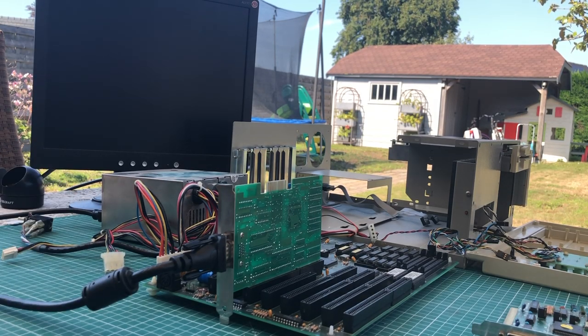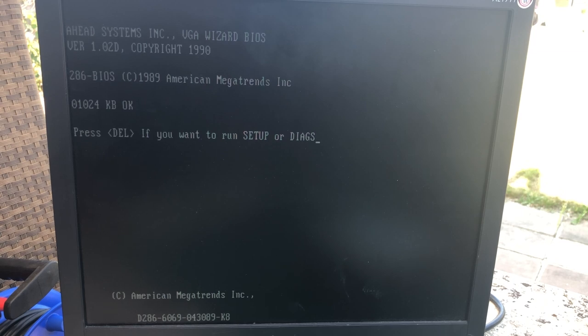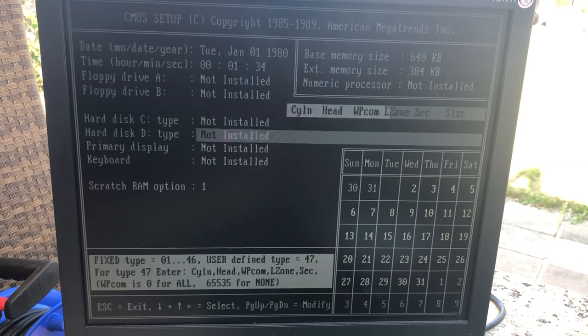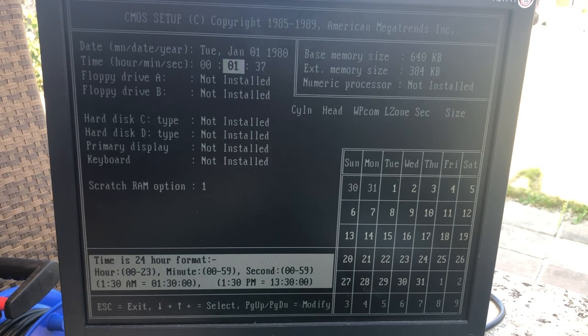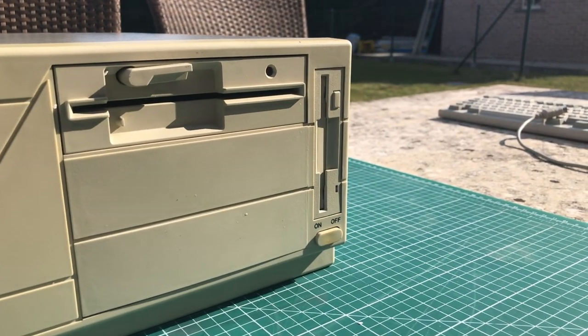Final test of the day: I've got the VGA card hooked up to the mainboard and the power supply connected. Starting it up — and holy moly, we get to see the 286 booting with a one-megabyte RAM count! There are going to be some setup issues since the battery has gone dead, but after hooking up a keyboard I'm able to enter the CMOS utility. Everything seems to be working. In part two I'll be completing the setup, reassembling everything, checking if the hard drive still works, and getting the machine completely up and running. I hope you've enjoyed this video — if you liked it please give it a thumbs up, consider subscribing, and I hope to see you soon!